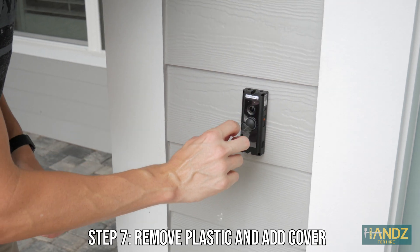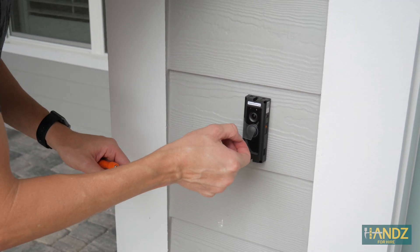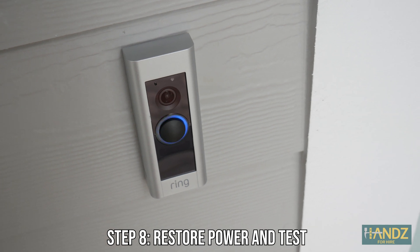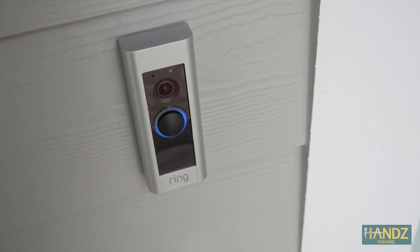Okay, final step: remove the film. Did you hear that? Roll back the tape. Did you notice there was a delay between the doorbell on the outside and the doorbell inside the house? I gave Ring a call and they said this is perfectly normal for this model. There's not enough power to simultaneously power everything at the same time when the doorbell is rung, so they divert power to the Ring doorbell itself to send notifications to your phone. After that notification is sent, the power is diverted back to the mechanical doorbell, and then the doorbell rings. This is why there's a delay for the Ring Doorbell Pro. Back to the tutorial.